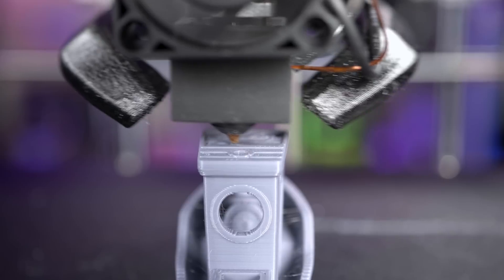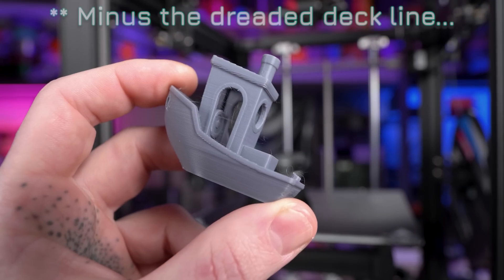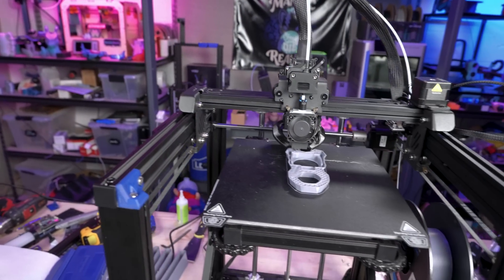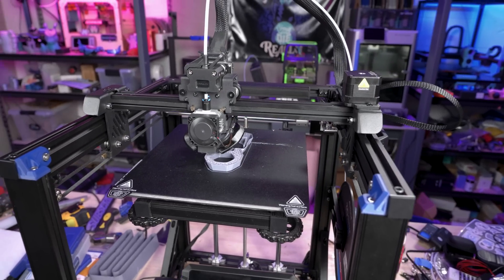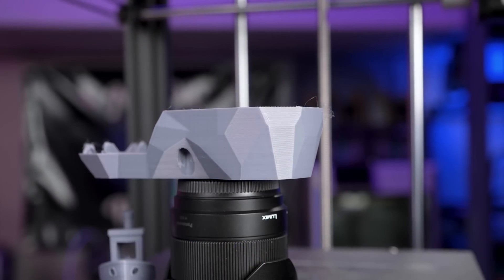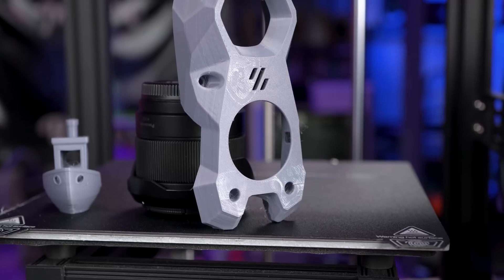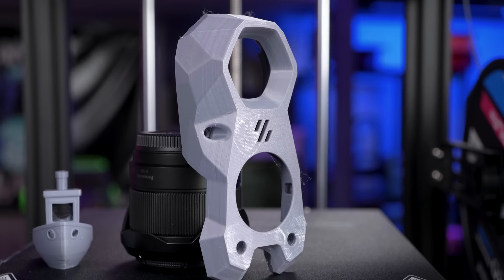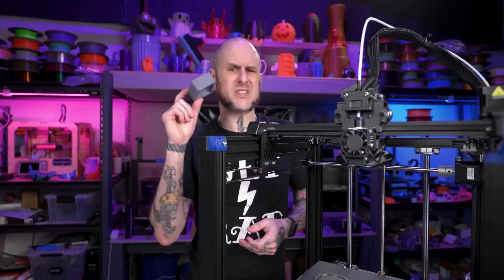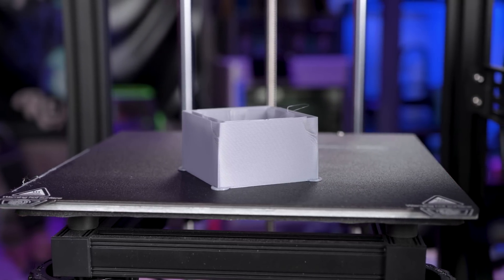The print quality also turned out a little better than I expected — a little bit of bow curling on the front from some over-speeding and under-cooling, but otherwise the overall print quality is pretty solid. The next thing I printed was what's become my own personal Benchy: the Voron Stealth Burner Shroud. This is representative of real-world printing I do regularly, with a lot of complex geometry, angles, and shapes that really highlights when a machine is working well. Overall, the print results on this are pretty darn good. The corners look like my pressure advance value isn't 100% dialed in, but I only did one calibration test before diving into testing. The layer consistency, the geometry, the corners — they all look pretty good. After seeing the Stealth Burner results, I decided to run the tuning tower for pressure advance to dial that in a little bit better, and I did end up at a higher pressure advance value than I had previously set with the Ellis test.